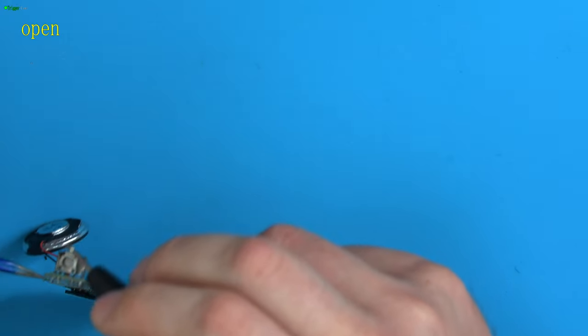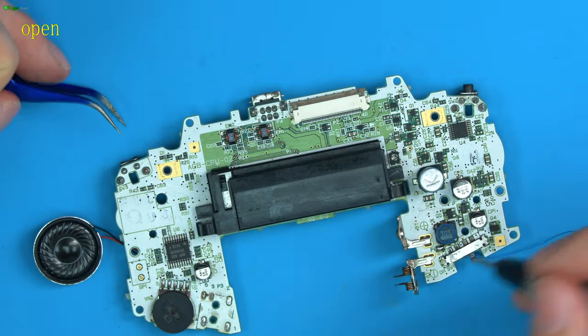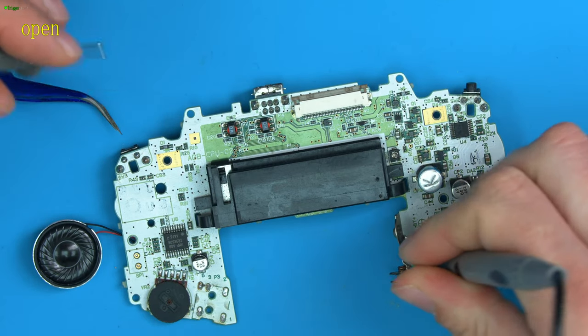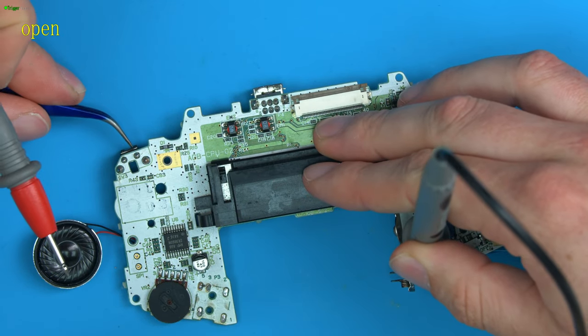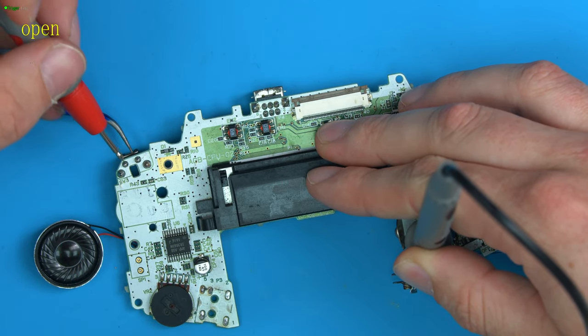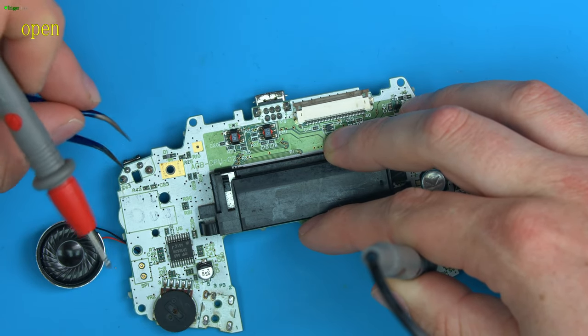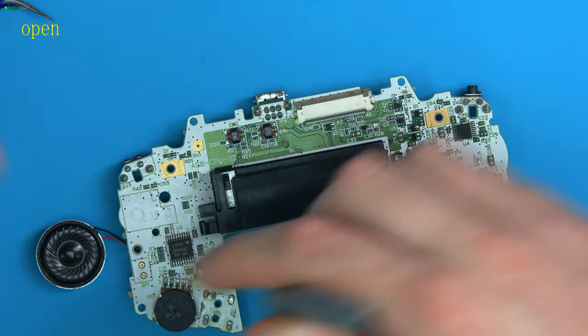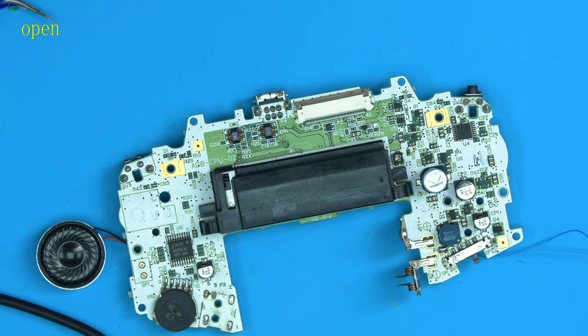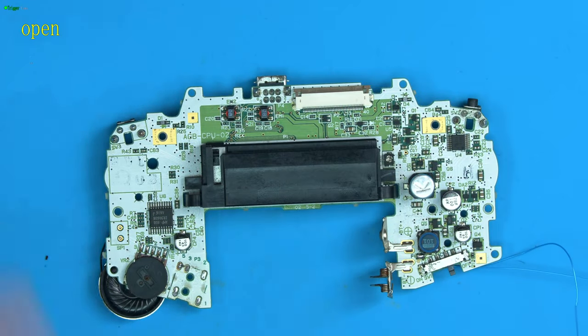This will be difficult to test because there's no rubber in. Don't know how I'm going to do this with one hand. Well, I know this pad's ground, so I can just go to ground over here. And I can try then to press in here while holding that down. Tell you what, let me just rob a rubber off a working board instead for the minute. If we have any with rubbers. No, I don't. So this one at the minute is hard to test because there's no trigger in. So let's ignore that for the minute.